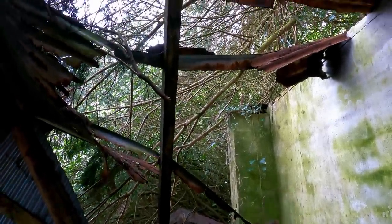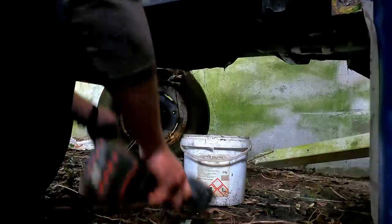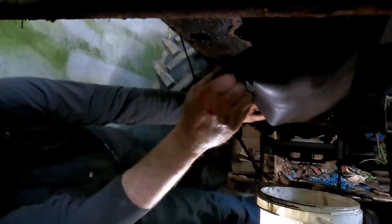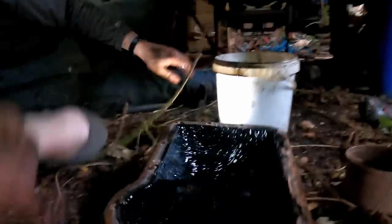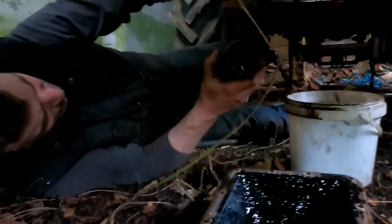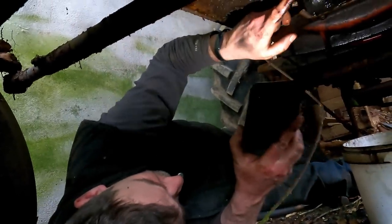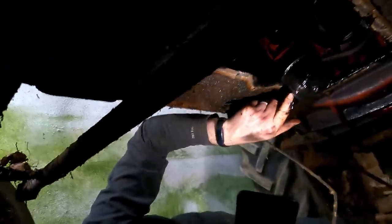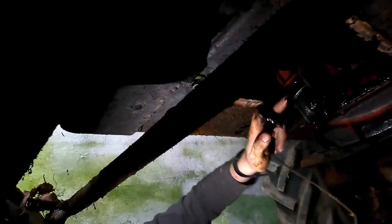It's starting to rain through the whole roof on me. And this thing has got some lubricating gasket on it. Yeah. The oil strainer is absolutely caked in crud and the sump looks brutal. So I'm glad I dropped this sump. Otherwise, it doesn't look bad. There's no corrosion or anything up in there anyway. But I'm going to take off the screen and clean it. I'll take the sump outdoors in a minute where you can see it. We're going to have to do a fairly heavy duty cleaning job on it. It just would not have done the bearings any favours if we started it like this. And it's somebody else's tractor, and it wouldn't cause damage to it.